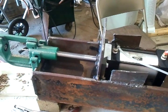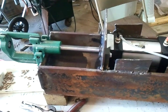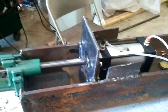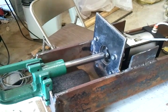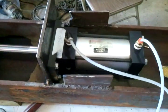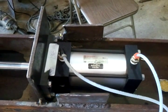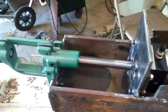Hi folks, it's Duke in Maine. I wanted to share with you my .22 long rifle brass de-rimming setup, which I just finished assembling with the assistance of my buddy Andy Quinzani. The previous attempt used a 2-inch air cylinder, which really just didn't have enough oomph to make things work. So what I've got here is a 3-1/4-inch cylinder with the same air supply, and this one seems to run really, really well.